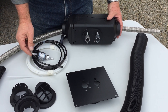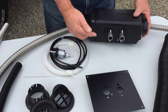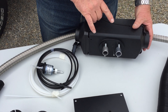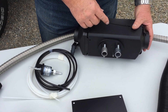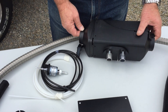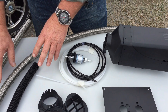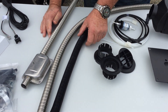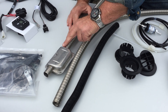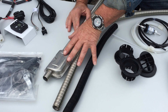The metering is coming from the fuel and that uses this particular fuel pump. There's an inlet and an outlet for bringing the fresh air in and removing the gases via the exhaust. Those outlets are connected by these particular units over here - this is the inlet hose and this here is our muffler exiting, and we'll have a real good look at how that fits underneath the van.